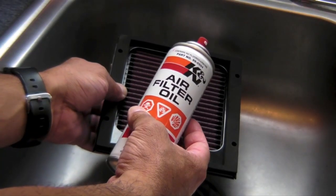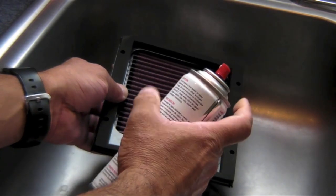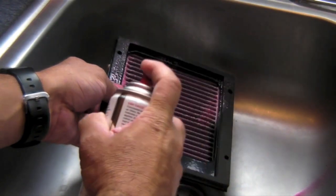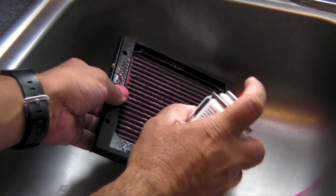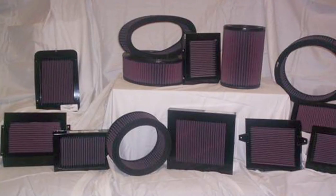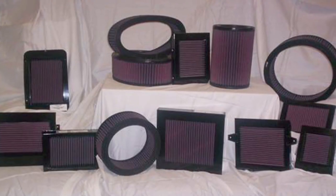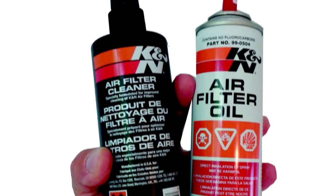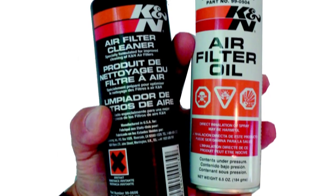The K&N element can be oiled and cleaned; in fact, it has to be cleaned and re-oiled annually or every 100 hours. Keep in mind that's going to be about an hour's worth of shop time — it's a tedious effort. The Challenger CP1172 series filter for a 172 is a whopping $219, in addition to the time-consuming effort it costs to service it.